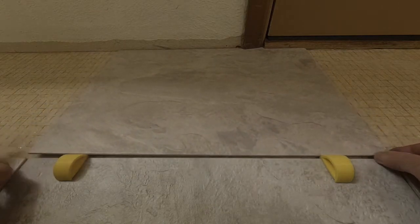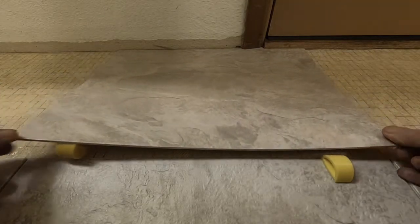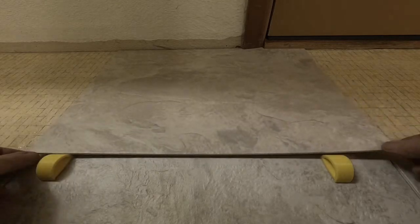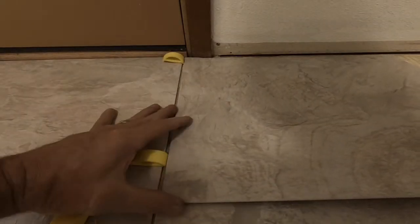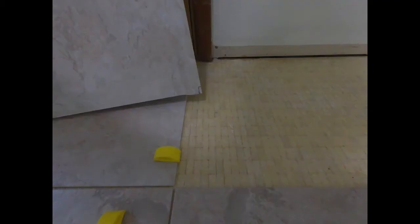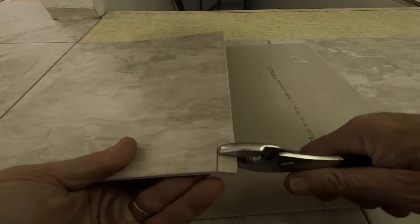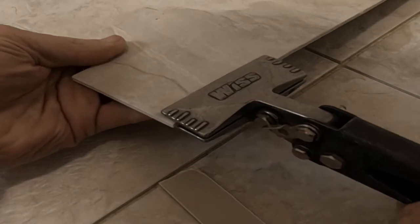Notice how the spacers provide a ramp to slide the tile into position. That is sticky glue — get out of there Archie. There is a subtle difference. You can use a tape measure if you prefer, but I think it's faster and easier to mark cuts like this. You can use a pair of pliers or channel locks to gain leverage when snapping off small pieces. This HVAC hand seamer does a nice job following the lines though.